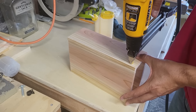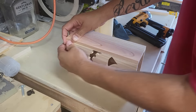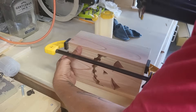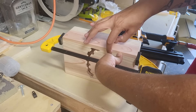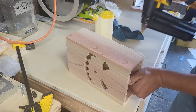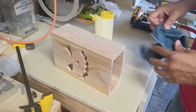If the nail was only protruding slightly and I couldn't push it back without causing more damage, I used a small punch to tap the end and bend it until it sank below the surface. On the inside you can just leave it. On the outside, I filled the hole with sawdust, added some thin CA glue, sprayed it with activator, and sanded it smooth. Once the stain is applied, it looks just like another rustic feature.